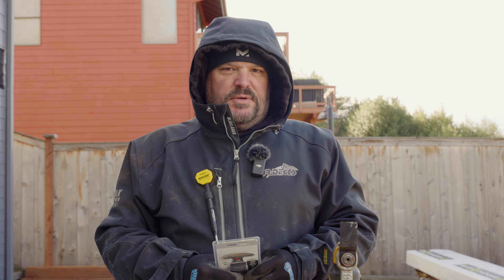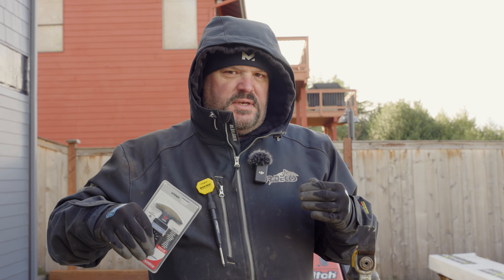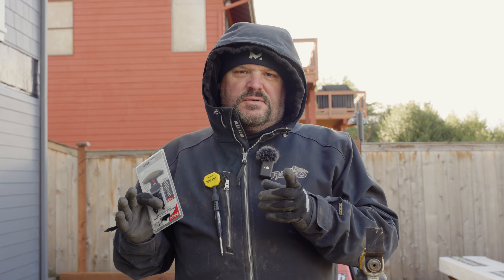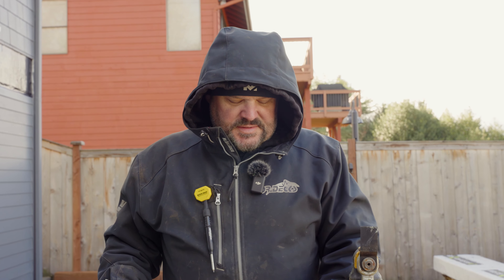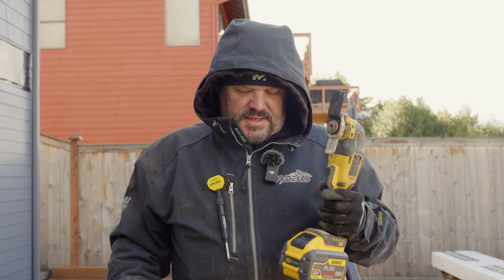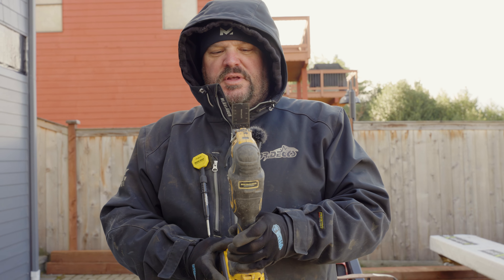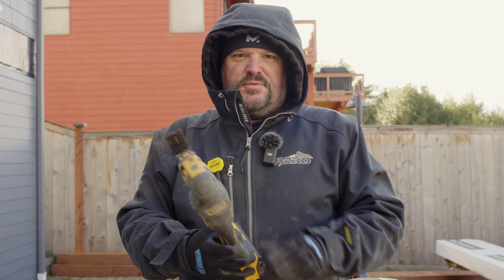The house that we're currently building on, we had to clear a bunch of siding — it's all cement siding. I have a cement blade on a skill saw that I was able to cut most of the flat lines, but every time I got into a corner or an edge and had to plunge cut, there were six inches or so of the cement siding that didn't get cut away. So I was basically just taking my oscillating tool with a fresh blade and cutting through the cement siding, which worked at first but then not so good.